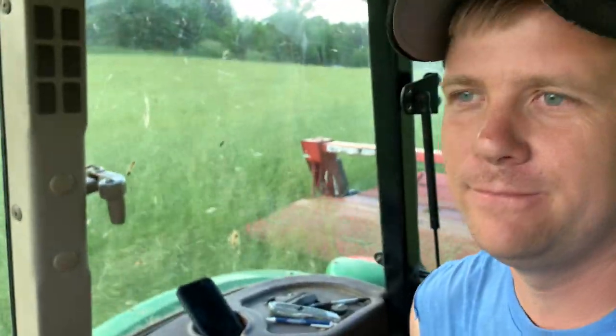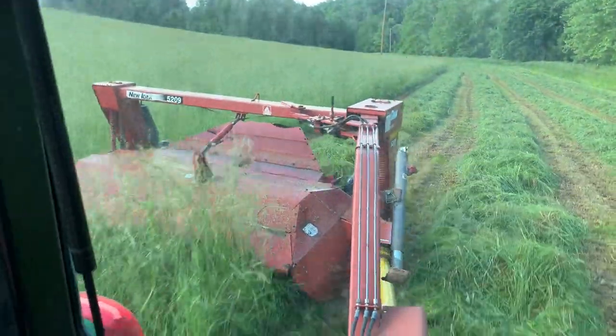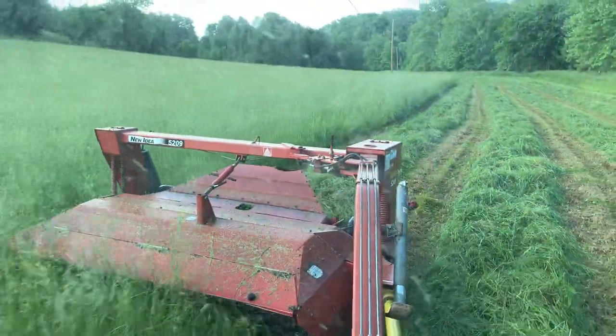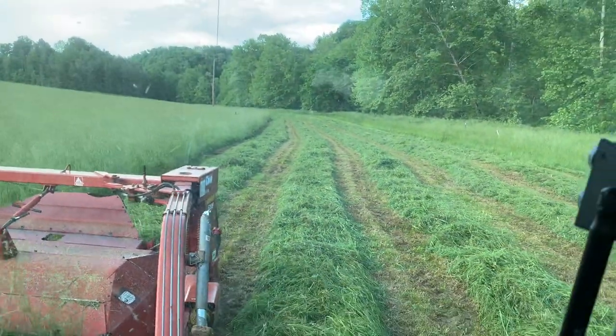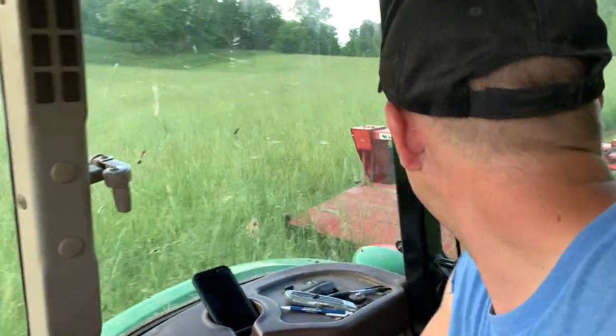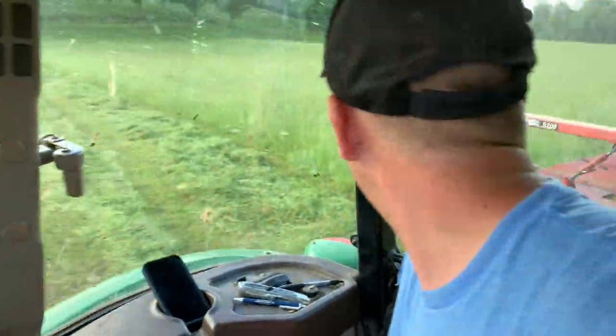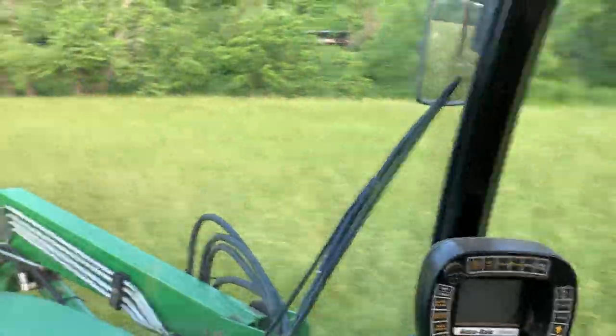When we got out and adjusted that, we measured the cutting height. This New Idea mower is super easy to adjust the cutting height. We don't mess with that a whole lot, but from time to time we do. We've got our cutting height right at four inches, so you'll have places that you're cutting six inches and places that you're cutting probably three inches, but for the most part we're right at about four inches. I'm going to go around the outside so you all have an idea of what that's like, but just kind of switching back.